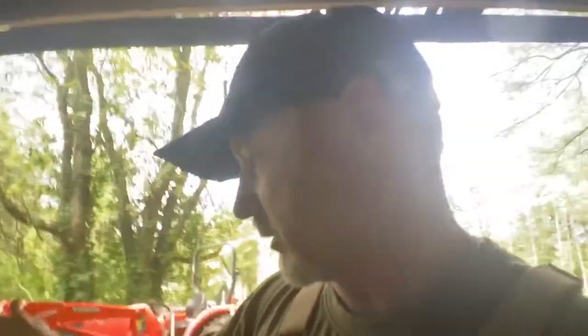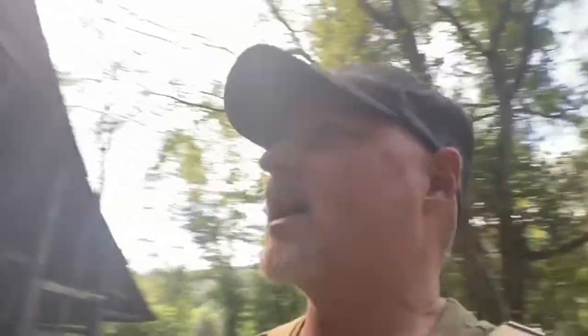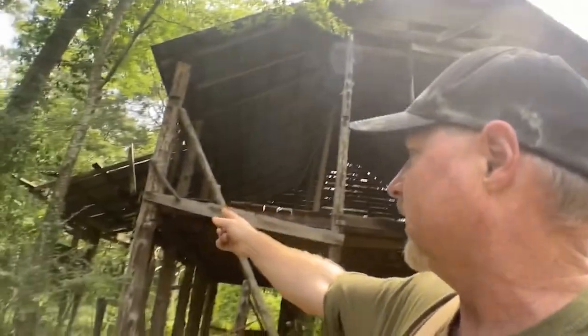And what we're going to do on the side, we'll have to put our girts up. We'll put our girts along the sides. And then I want to do the board and batten, the very same type that we see on the cabin. So we'll have board and batten going the full length of the whole side of this thing. But in order to do that, we have to clean this off. We've got one lean-to over here that I think I'm just going to go ahead and take down.